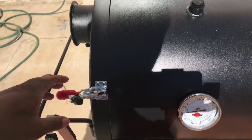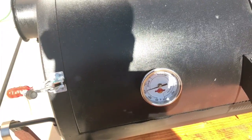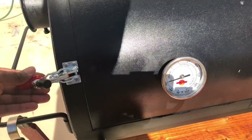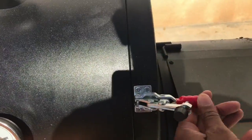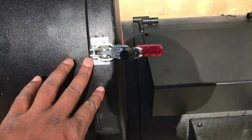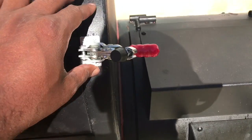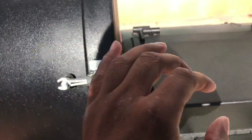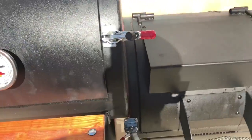Next, we can go ahead and talk about these latches. These are the Lavalock latches. Got those again on eBay. I like these because they open at 100 degrees. I got a set initially, but I think they're 85 degrees. So you have to be kind of careful about where you put it on the edge of this smoke chamber here, the cooking chamber. Now these, they're smaller. They have a smaller base, so you can fit both nails on both sides of the screw, on this here instead of having it stick out back over here. And you don't have to worry about it, when it opens, because it's opening at 100 degrees, for the ease of opening the cooking chamber. Works out perfectly.